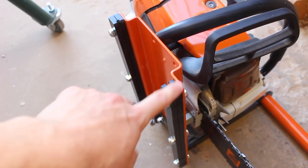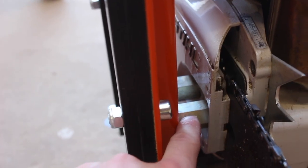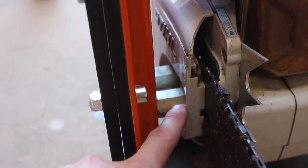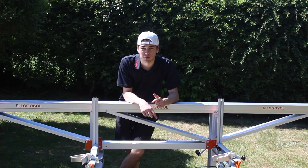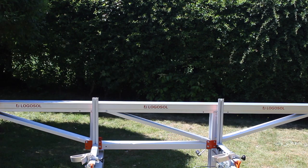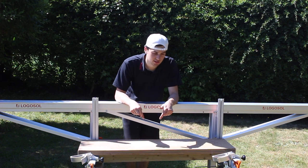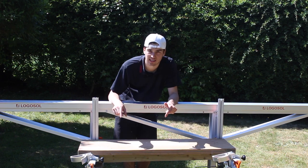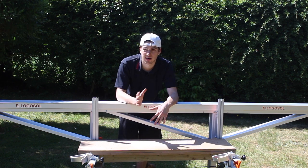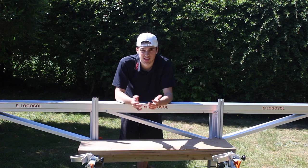The chainsaw is mounted to a carriage which slides along the sawmill track. You attach it with just two bolts using coupling bolts that come with the sawmill — they replace the standard nuts on the cover and have an extra thread on the end so you can attach the carriage. The Logosol F2 was designed for milling boards and rip cutting, but cutting cookies isn't a problem. I've made a board that slots onto the log lifters, and you can screw your cookies down to the board to lift them up. This way the possibilities are endless — you can cut all sorts of things at different angles using different jigs, as long as it's supported by the log lifters.